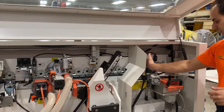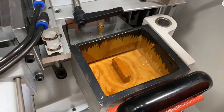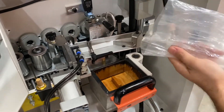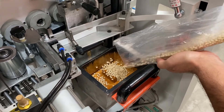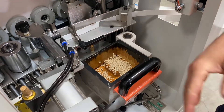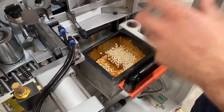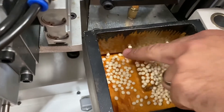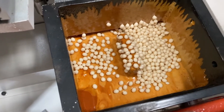This is our glue pot here. To put in glue we just pour it straight into the pot. The pot is Teflon coated, so don't use anything sharp in there — otherwise you'll scratch the coating that helps prevent the glue from sticking. When you want to add more glue, just pour your glue pellets in and let them melt. Once the glue's melted you can keep running and it'll mix with the old glue in the machine, keeping it a nice consistency and stopping it from burning. Don't fill it more than to this gap down here — you need that little gap at the bottom to allow the glue pot to breathe. There are two chambers, one here and one there, which allow the glue to breathe, prevent it from burning, and keep it a lot cleaner.